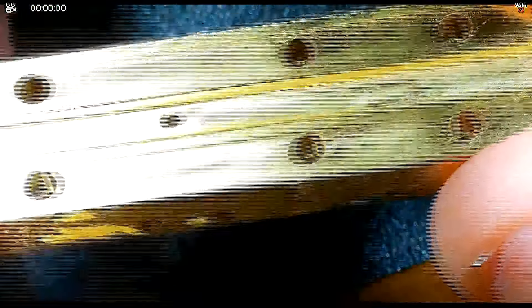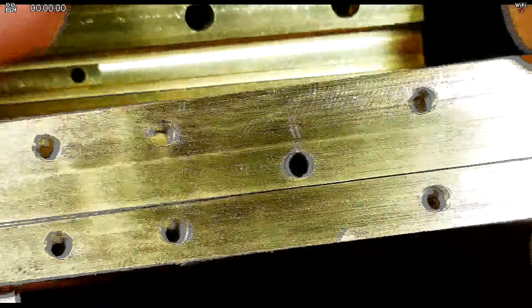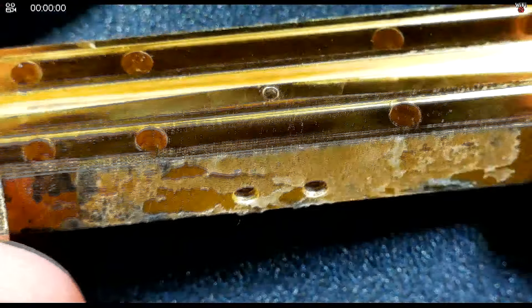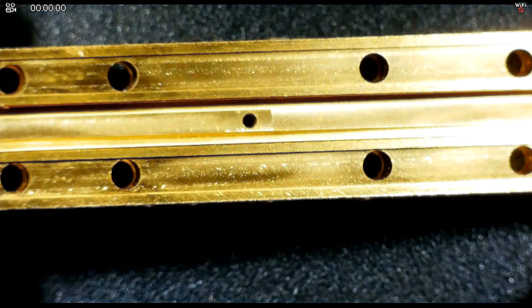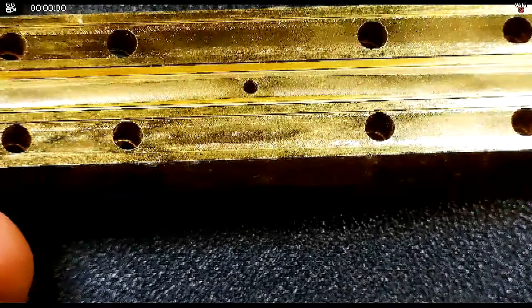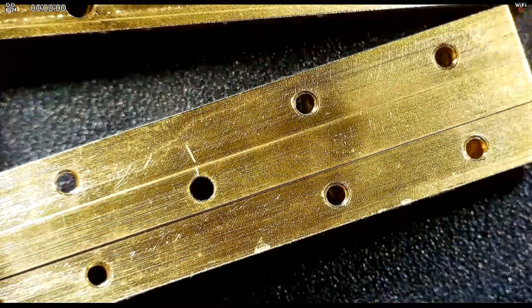This is a 75 to 110 GHz mixer so the waveguide size is WR10. For higher-frequency versions, you'd simply scale the dimensions — the 90 to 140 GHz mixer has a smaller waveguide but exactly the same structure. That's the beauty of the physics: you can make this at essentially any frequency by scaling dimensions and the diode. The conversion loss just gets worse at higher frequencies. You could even machine this on a basic CNC machine. All the secrets of this mixer are now known.